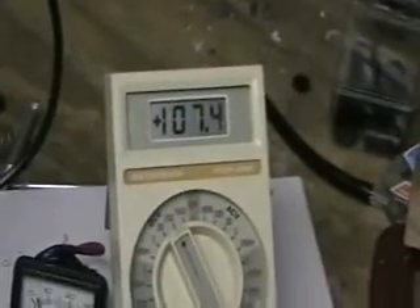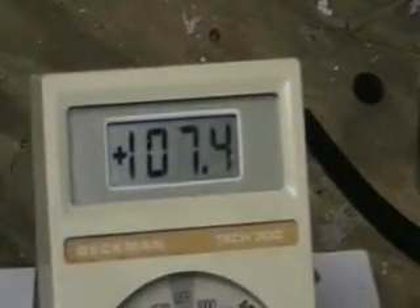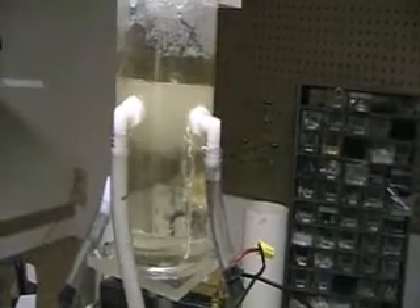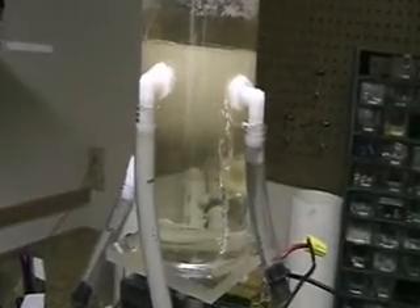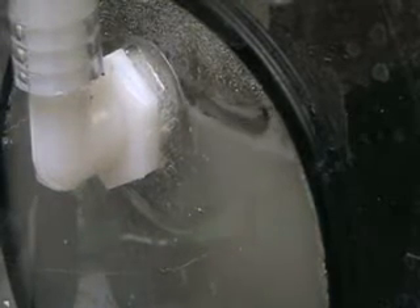Being the twin cell, the bottom cell I'm not using. What I'm doing now is setting up the voltmeter on the DC side. You can see the voltage that's coming out — this is coming straight off the bridge. It's running at 107.4 volts right now. You can see the amperage here — it's about five amps at 107.3 volts. I'm not going to be doing the output test just yet. This will give you an idea of what's going on in the cell.